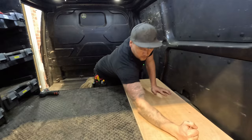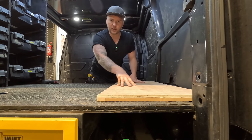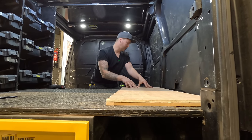That's square down there, the weight is now shared all the way across. We're going to whack some screws down, put the rubber on that now, get that cut to size, we'll spray it, then screw this down to the 18mm ply, and stick the rubber on top so we can get our mounting plates on that as well.